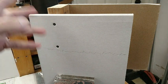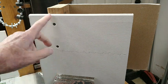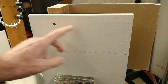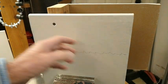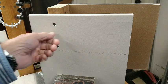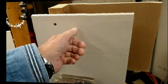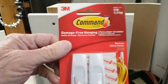The stud, or the 2x4 in here, is 16 inches away from the next one — they're 16 inches on center. So I would have a spot where if I try to put something in, the hanger will generally be very different than something put between the studs.